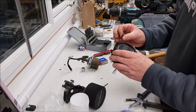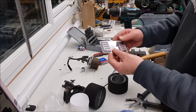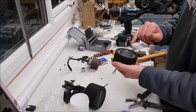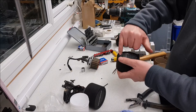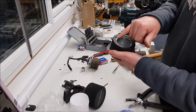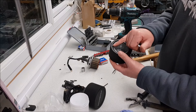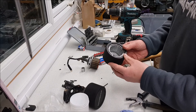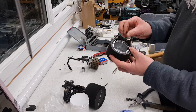The only thing you can do - and I've just done it with two of them - I managed to undo four of them using brand new decent screwdriver bits. For the stripped ones I've drilled them out, using a smaller drill bit. These are 4mm screws, so I started off with a 2.5mm bit, went straight down the middle of the head and through the screw, then put a wider bit in until it goes thin enough and they literally come out. I managed to get them out without damaging the threads, which is very good.